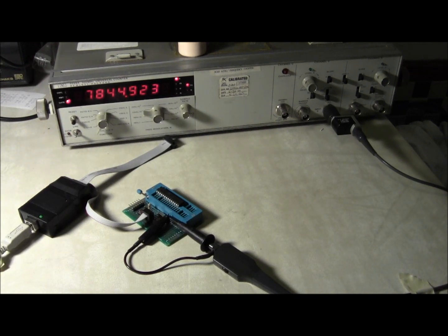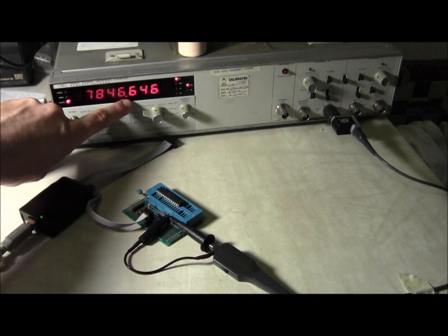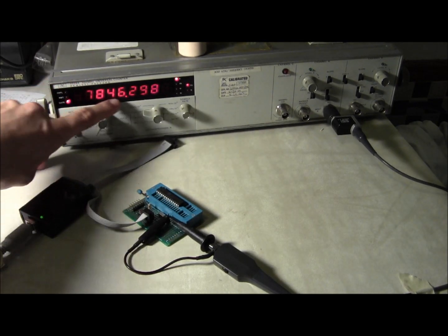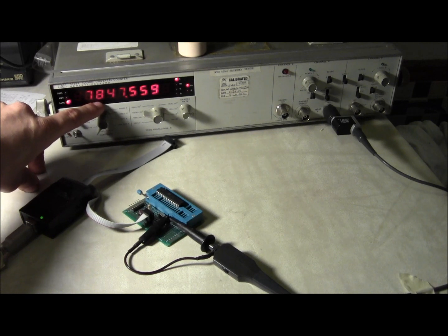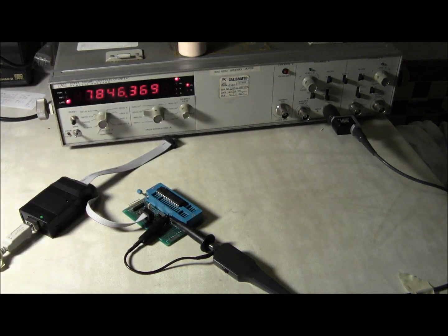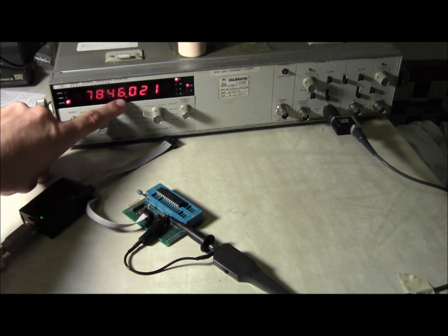Profoundly, we see not 8 MHz. You can see that it is 7.84764 — so about 7,800 KHz. This is about 150–200 KHz slow from 8 MHz. I want you to also appreciate how much it's jumping around — this oscillator is changing frequency by a couple KHz, which is about 0.1%.